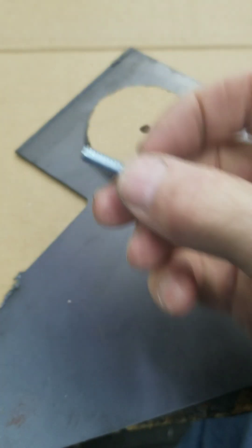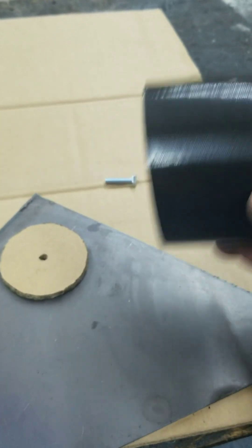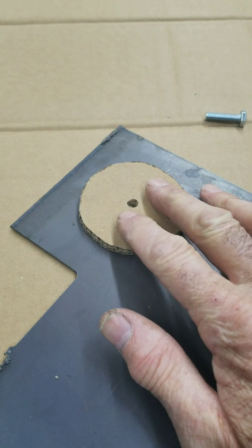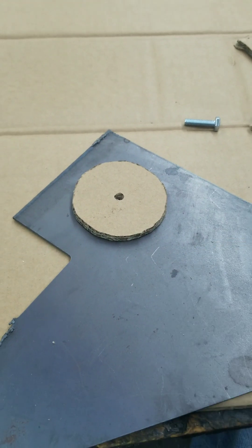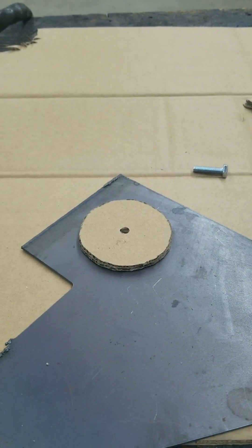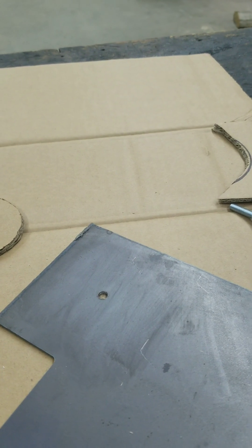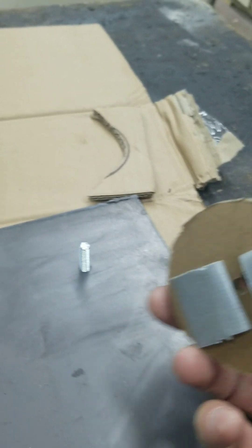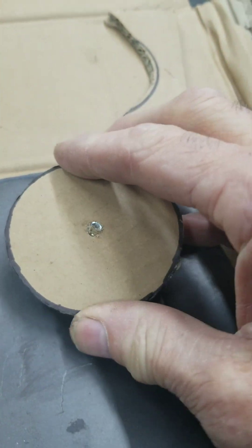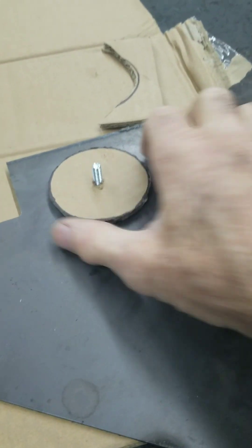I'm going to use a bolt through from the bottom to hold it in place, and probably a couple of pieces of looped tape with the sticky side up on both sides. The cut is so quick and not actually against the cardboard, so it generally doesn't even burn it. I'm giving the steel a bit of a cleanup because I'm going to use some tape on the back — I take some acetone and wipe it to make sure the tape sticks well. I put the bolt through the back of the cardboard, stick it on, push down, and now it's on there really good — that's not going anywhere.